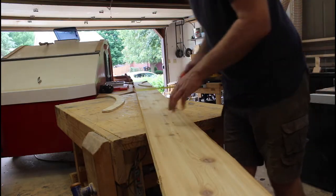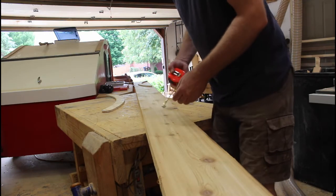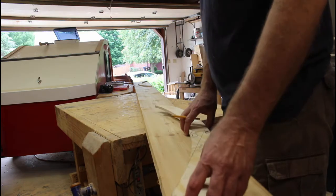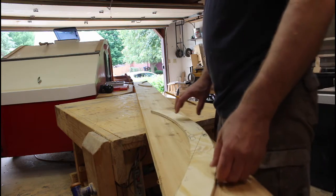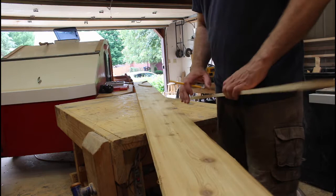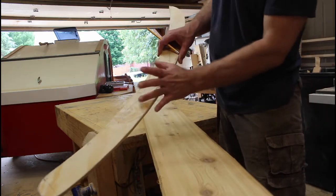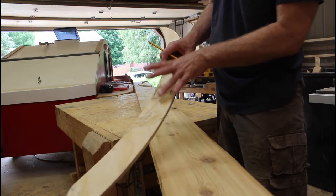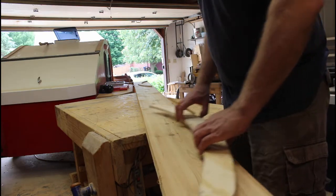I've got my material — I'm using Western Red Cedar. These actually came from utility poles that a guy milled up and I bought from him. They're a little more than one and one-quarter inches thick. Now I'm going to use my templates to draw out where I need to cut these on the bandsaw. There are a lot of knots on here, and the most important thing is in the area where the seat is going to be — that needs to be the strongest — so I'll try to avoid any knots in that area.